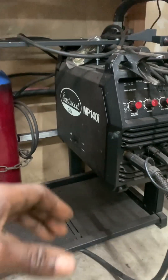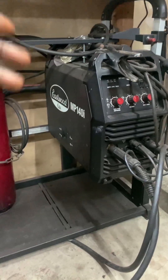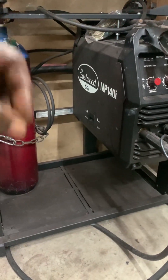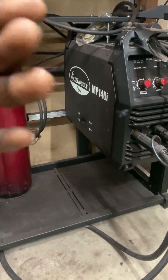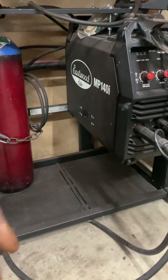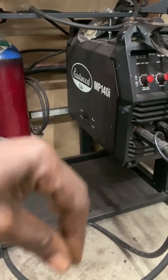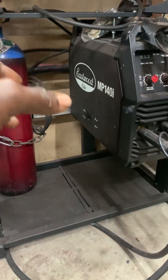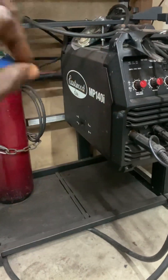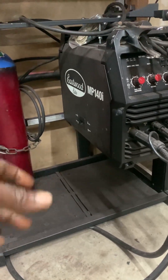What I actually did was — because my breaker box is so far away from where the shop is — I used 10-gauge wire, which is good for up to 30 amps. I installed an outlet directly at the breaker box because I didn't want to go through all of the requirements, labor, and costs of running it through the building down to the shop. Basically, I installed an outlet directly connected with a piece of conduit to the bottom of the sub-panel, where all the breakers are, and there was one open slot left. So I installed about a foot of 10-gauge stranded THHN wire coming from a brand new Siemens 30-amp breaker that's all by itself — nothing else on that circuit besides that outlet at the bottom of the breaker box.